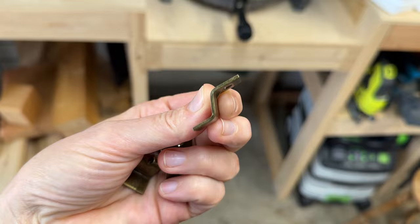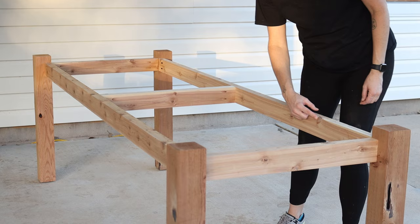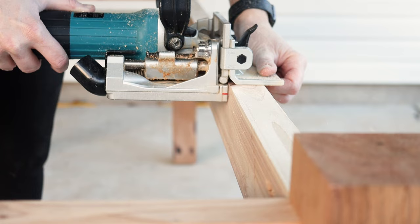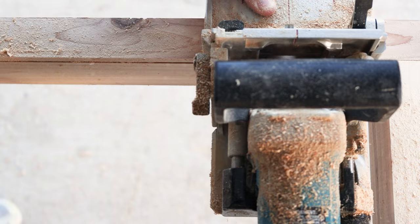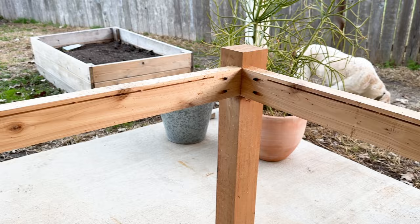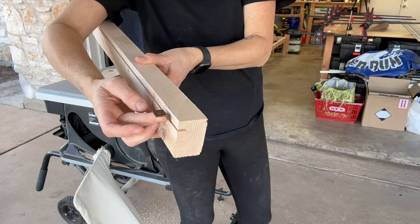To attach the top, I'm going to use tabletop fasteners, which connect the tabletop to the base while still allowing the top to expand and contract with humidity changes. I need to cut a groove in the base — my biscuit joiner is perfect for this, but you could also use a table saw or a circular saw to cut a groove in the apron before assembly. I cut into one end and slid the joiner down the length of the apron without letting the blade come back out of the wood, which cuts a great slot. I repeated the process around the whole base. Alternatively, you can run your apron boards through the table saw one time and you're left with a simple groove that fits the fasteners perfectly.